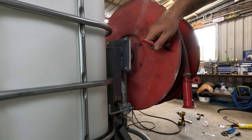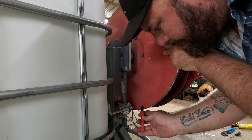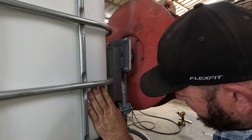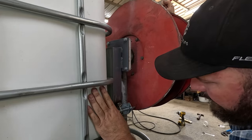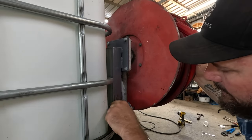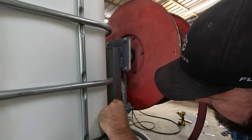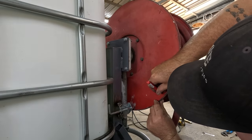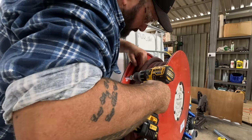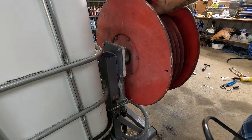Mark a few spots, maybe four. And one about there. And then all I do, I just loosen this off. And that scratches the line exactly where I need to drill the hole. That'll be one hole where the cross is. Two holes. There you go. Locked in place.